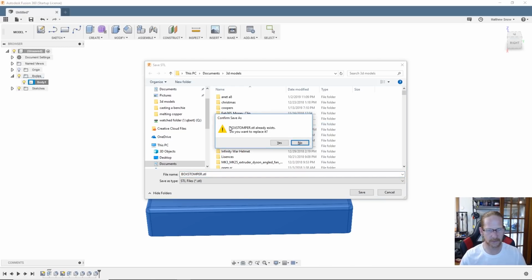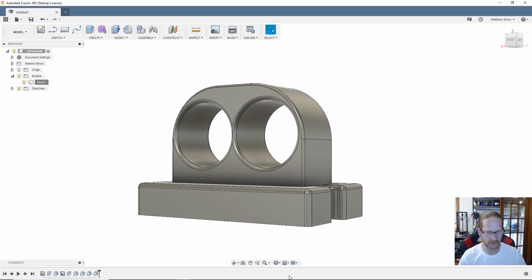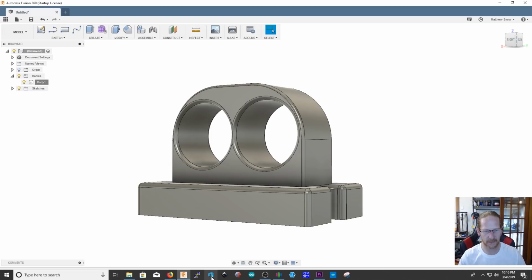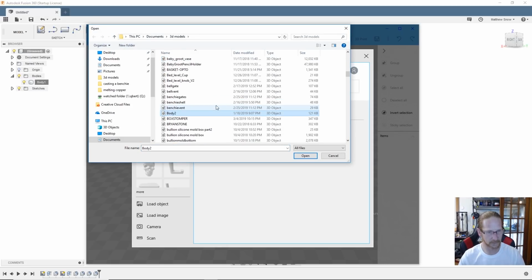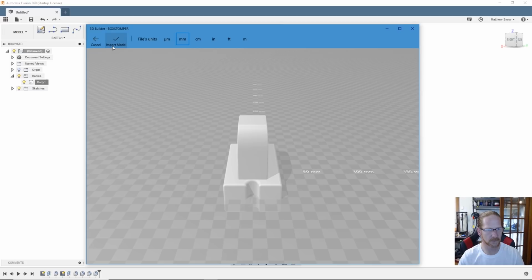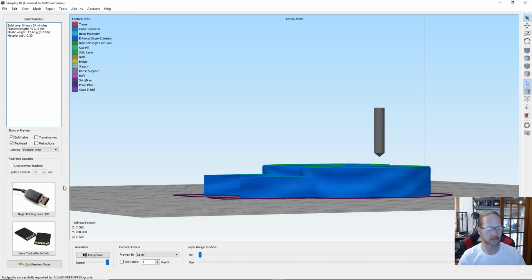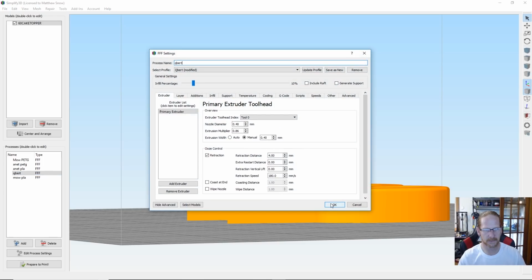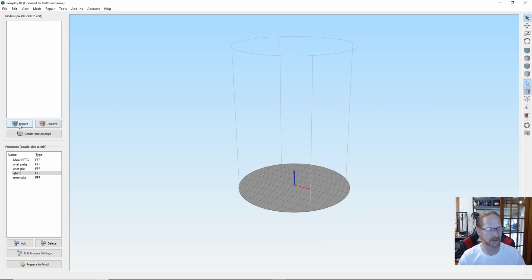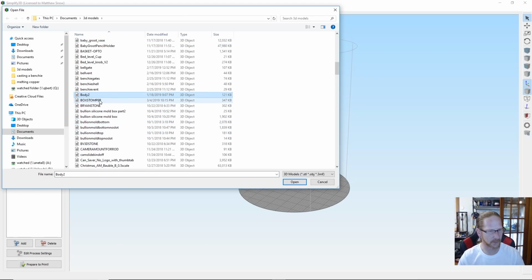The Box Stomper. And let's, once again, we will check it with 3D Builder. All looks good. Bring it back over to Simplify 3D. Let's bump it back up to 15% infill, and at that point we'll just let it print. The Box Stomper.